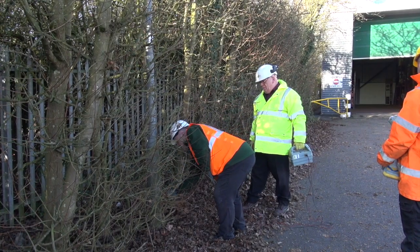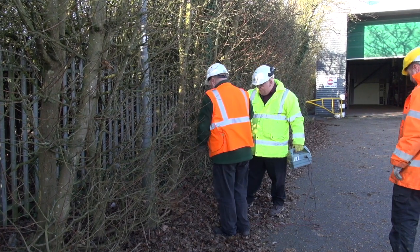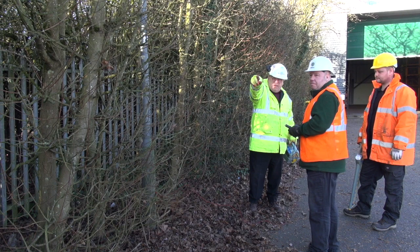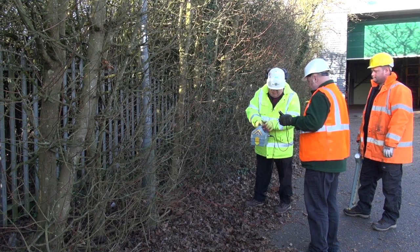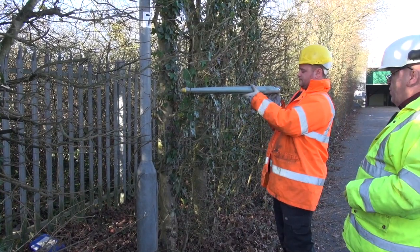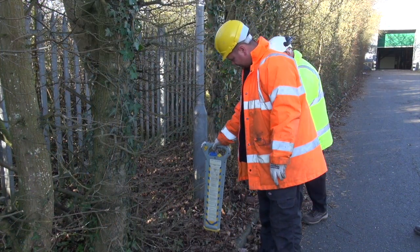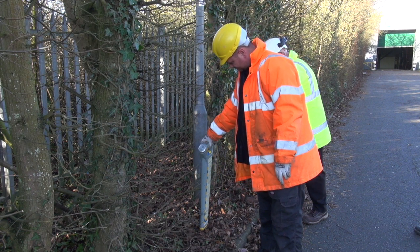Don't connect it up on the fence yet — because we know the cable is running that way toward the next lamp column down there, it also runs along that fence. You don't want to connect it that way as it will put a signal into that cable. Now come back — good. Go forward, don't touch the control. Now just turn the CAT — it disappears. Turn it back.